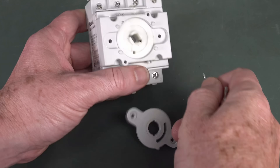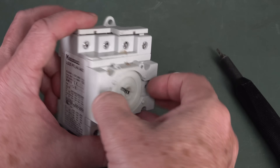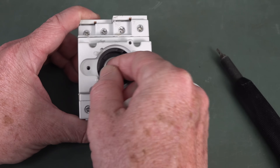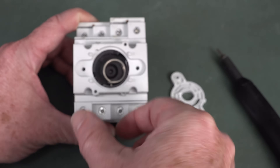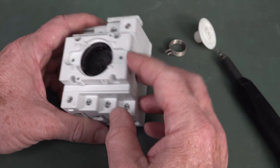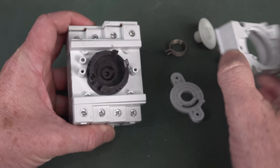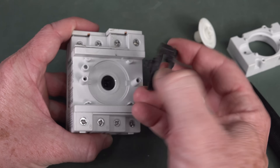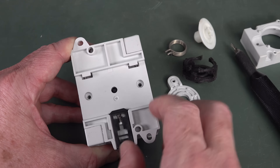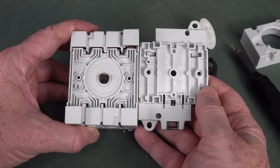So we've just got some self-tappers into plastic there — and it's fallen off already. That's just the top part there, and this knob should come out. We just have a big stiff spring arrangement in there, because these are very big, clunky — they really require a lot of force to actually turn them. So that's just how they do that in the top. But we're really interested in the layered contacts and how they do the arcing prevention and stuff. This will lift off. That's all just the top switching mechanism. And then the bottom one just has two self-tapping screws — there's a DIN rail arrangement here, just a little clip for the DIN rail. So we can take off our first level here.